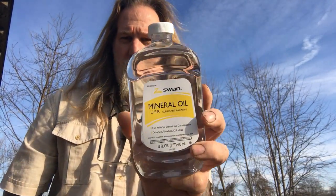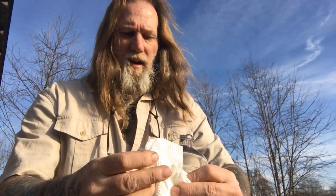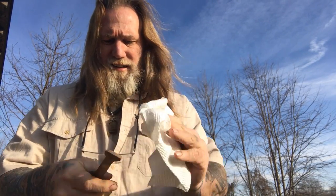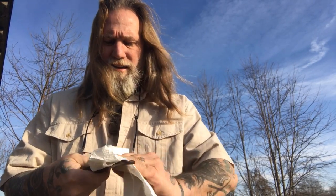I also get a lot of questions about how to seal these projects when done. I've just finished the final sanding on this walnut spoon, so I'll show you how I seal it. I use regular mineral oil bought right off the internet — this is a brand new bottle I haven't opened yet. I punch a hole through it, then take a rag, saturate an area of the rag with the mineral oil, and put a good healthy coat on the walnut.